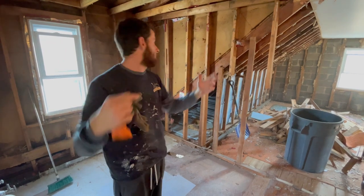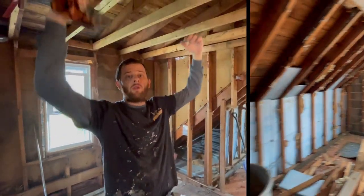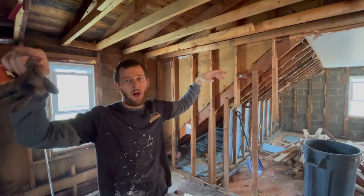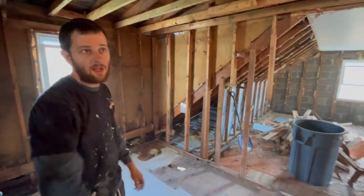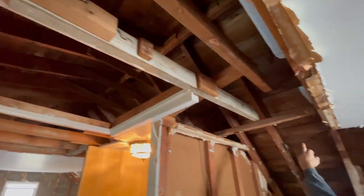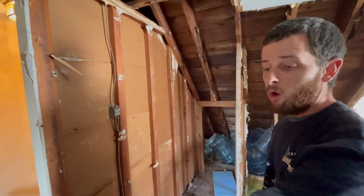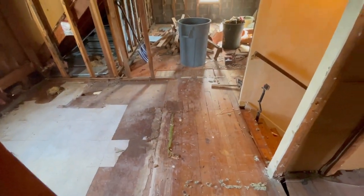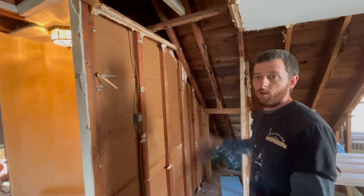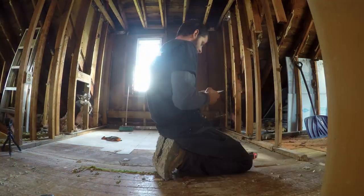You're not going to pre-build a wall and try to stand it up in this little space. We'll use a laser line to measure for our ceiling joists - whether we need to push up or bring down, it doesn't have to be perfectly level, we just need to get everything in line so when we go to sheetrock it's nice and flush. We'll have to reframe these closets that are just hacked to pieces. I'm going to build my wall first since I don't have 16-foot two-by-fours, then I can throw an 8-footer in for our ceiling rafters.